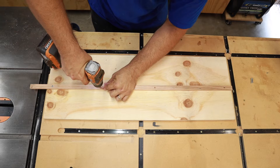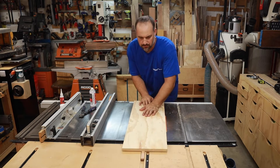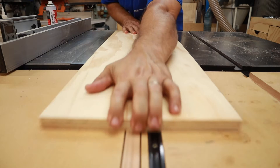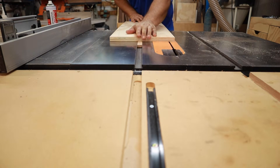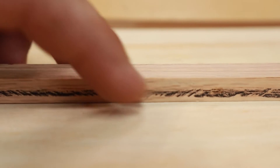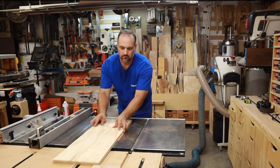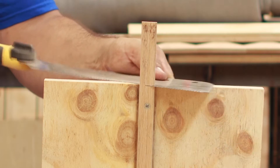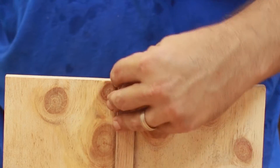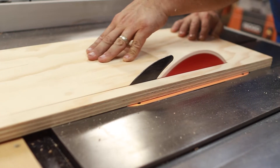The screws are going to give it that permanent connection. Even though the runner fit in the slot perfectly to begin with, now that it's mounted with the screws it's a little too snug. So I like to take a pencil or a china marker and make a line along the edge of the runner, then slide it back and forth in the slot and inspect the marks. This can give a good indication of where the runner is rubbing. I just take some sandpaper and sand it a little bit, test fitting along the way until the fit is back where I like it. Then I cut off the excess runner and use a chisel to bevel the front corners, being very careful not to stab myself in the stomach with the chisel. After that I raise the blade and make a cut that gives me that nice crisp edge — and this is why I made that piece of plywood a little bit wide to begin with.